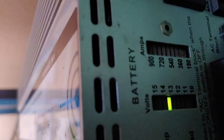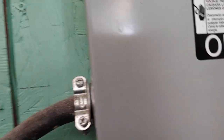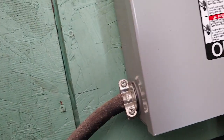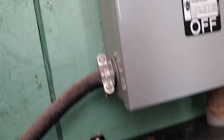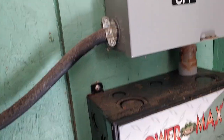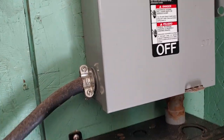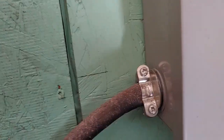It's jumping back and forth — the inverter's not happy, and it looks like that here isn't happy either. We'll have to take a look at our circuit to see if it's causing the problem. It's at 12.6 and I'm not sure what the inverter is doing. I suspect it might be the circuit breaker causing the problem. Successful test for the batteries — not so much for the inverter and the circuit breaker.